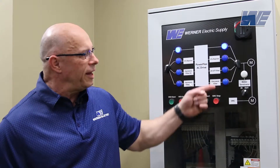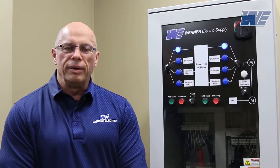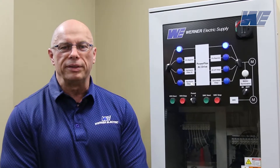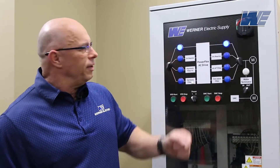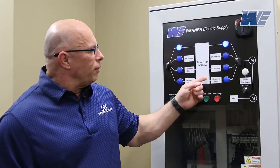The video we're going to do today is associated with the output side. We have a pulse width modulated, 3 horsepower PowerFlex VFD. We have 500 feet of cable between the drive and the motor. We're going to have our oscilloscope terminated at the motor. We're going to look at the output without a filter, add a 3% output reactor, add a DVDT filter, and also look at a sine wave filter.